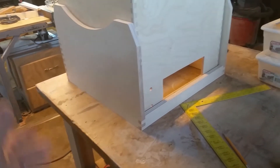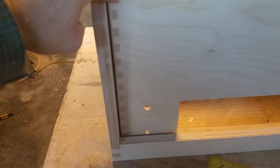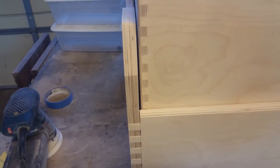I've fitted the rocker box and put the mirror box inside. We want to see — do we have a gap on the side? We do. Here it's just under an eighth of an inch, and same on this side, just under an eighth of an inch. We'll make sure we still have it on both sides. There is just under an eighth of an inch, and tilting it back — everything's going to work out right.